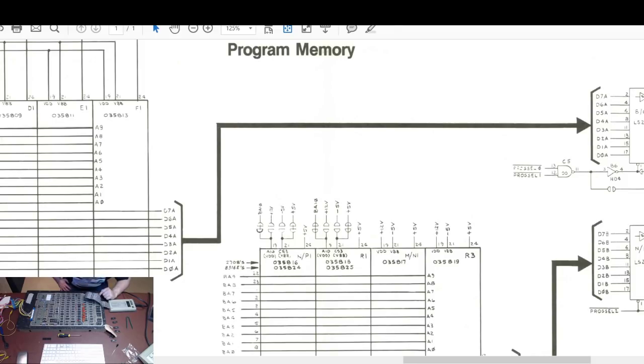The only way to really figure it out is to take all three of those chips out until we get a stable data bus, because snipping the legs on them, which is another common technique, won't solve the problem. So it doesn't matter what I'm doing, whether I'm touching the board or not, I'm getting an okay some of the time. So let me just touch these chips.